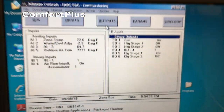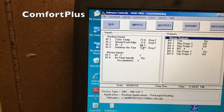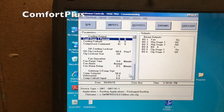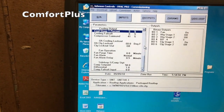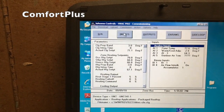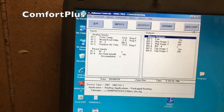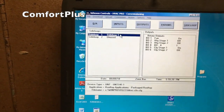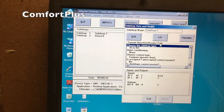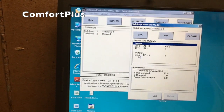Cooling stage one is on, but I've got cooling stage one and two on because I've got them both under the same output — and you can see that humidity just keeps on dropping even though the zone temperature hadn't changed much. It's going to be heading for a zone temperature of 71.1 and currently we're at 72.6, so we'll get a pretty good cycle time out of this. We've got a side loop which basically says if the air conditioning is on and the humidity is above 50%, then activate output number four.